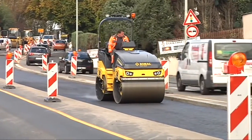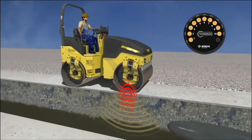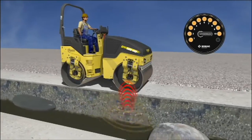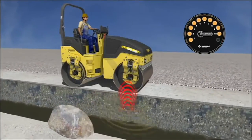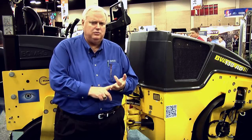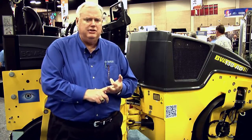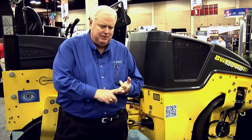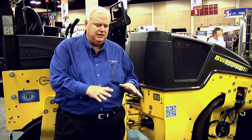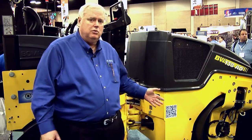One of the largest problems with failures in commercial work is really what you're working on. There's been no improvement to the sub-base, or the base may have a hydraulic problem — water, organic material, or even tires buried down there. There are problem areas that you can't compact: you can't compact water, you can't compact old tires. Let's find out about these problems before we enter into this with hot mix or even warm mix, because it's not an inexpensive item. Let's make sure the base is good by proof rolling the area with the unit before we even put the mix down.